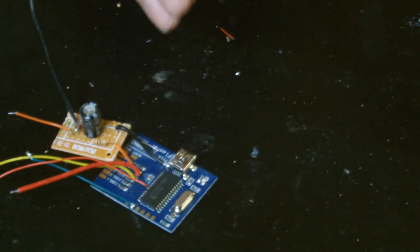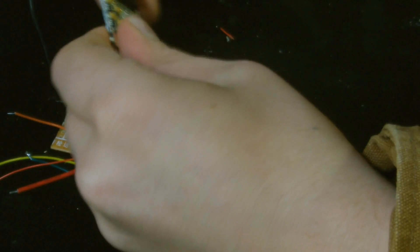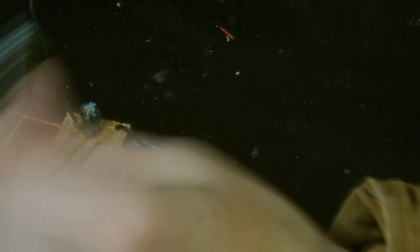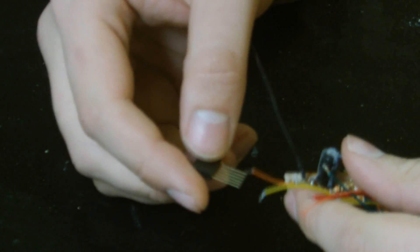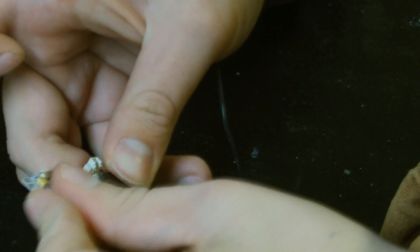I actually cut this board down to size and put on all the other wires. What I'm going to add now is this pin header. What's nice about it is that you take your cool runner and it fits right on the pins, so instead of soldering all of these each time I want to use a cool runner, I can just plug it in. These were really cheap — probably like a dollar for ten of them. I'm going to cut down these pins on the end and solder them on their corresponding points so whenever I want to program the cool runner, I can just plug it in like that.